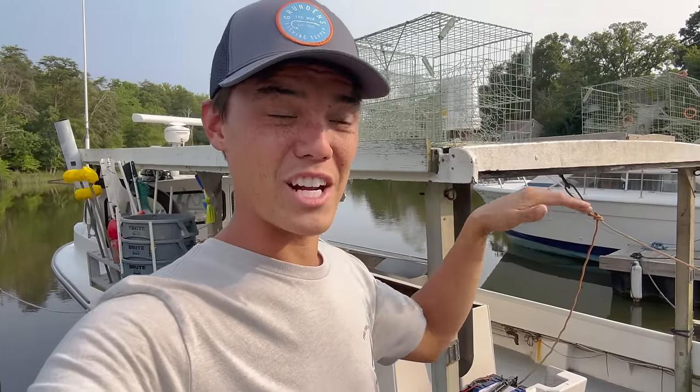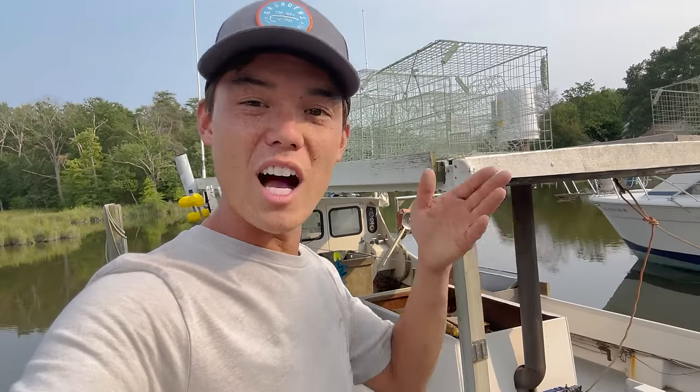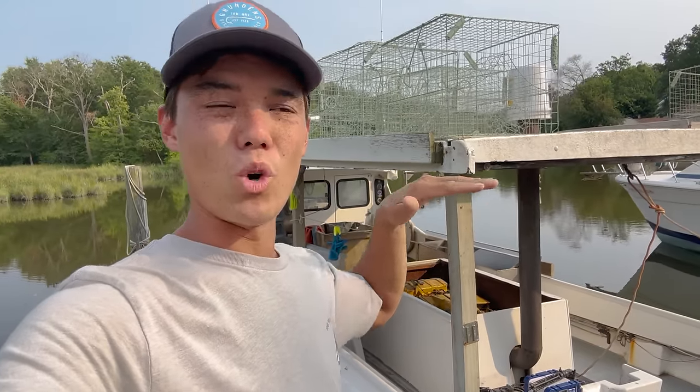You want a lot of usable square footage, which means you're not wanting consoles or anything extra on the boat. You also need a boat that does not draw a lot of water. Here in the Chesapeake Bay I crab in less than five feet of water, so I don't want a boat that draws a lot — meaning there's a lot of boat under the waterline and you cannot run it in as shallow of water. You want a boat you can run in shallow water, or skinny water as we call it. The Southern Girl is basically a flat-bottom boat — the hull has a dead rise, which refers to the obtuse angle. If you look at it from the stern it looks like almost a flat-bottom boat. The Southern Girl did not originally have a keel, but when they cut it down and turned it into a crab boat they put a keel on it, just to keep it more stable in the water and to help the boat track well. If you're trot-lining or something, you need the boat to stay on course when you take your hands off the controls, so it doesn't yaw — meaning the boat moves laterally through the water. The keel just helps keep it stable in rough water.